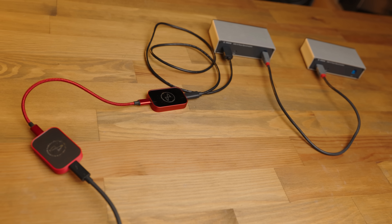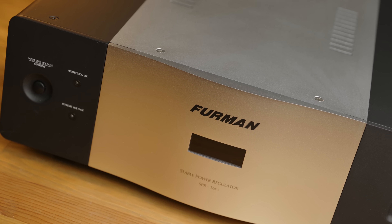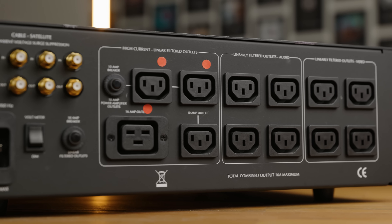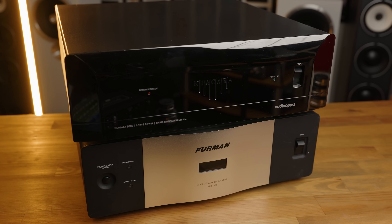I almost forgot to mention: whilst we're powering this device via USB and we've done all we can to make sure that the USB power is as clean and isolated as possible, one thing we've not done is made sure that the PC getting clean power — otherwise it's not doing much good to just have a USB isolator there. So I made sure the PC powering the Motu M2 was running on a power conditioner: a Furman SPR16EI, which is a voltage regulator providing a stable 230V output with pretty effective power conditioning filtering. And just to make sure there was no lingering noise that could possibly get through to the output, I routed the power from the Furman into an AudioQuest Niagara 5000 power conditioner.